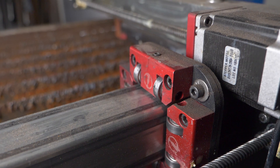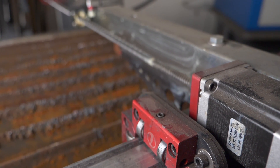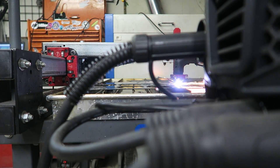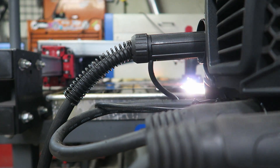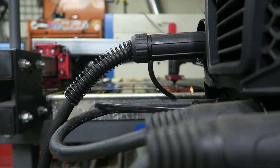The biggest flaw I can point to is that the drive motors seem to be underpowered. When you are rapiding between cuts, this has happened numerous times for me — when it's trying to rapid quickly, the drive motor will be overloaded and it will skip several notches. Then your entire pattern is now shifted. You've got to slow everything down to keep the drive motors from being overloaded.